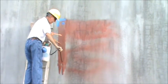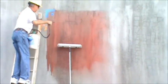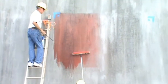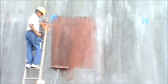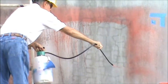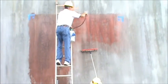A light mist is first sprayed on the surface to begin the capillary action, absorbing the product into the concrete. A roller is then saturated to make sure that it's completely wet and the surface is back-rolled. This back-rolling operation not only ensures good even coverage, but more importantly, it keeps the product on the surface a sufficient amount of time to allow it to penetrate as deep as it possibly can into the shotcrete material. This is referred to as dwell time, and it's very important that we keep this surface saturated wet to allow the deepest penetration possible. You can see that as one person with the spray rig is spraying, another is back-rolling to keep the operation flowing smoothly.